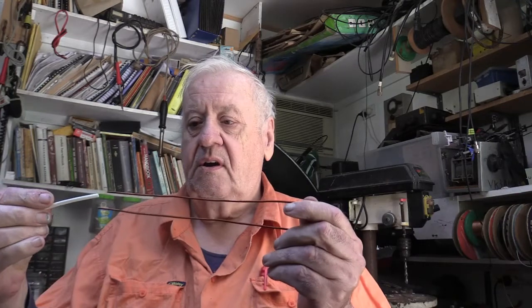This particular balun's only got two wires in it, so it's not too bad. But what I discovered was a friend of mine, VK3ACJ, suggested that I get a little bit of shrink on. And what I actually do is I cut a small piece of shrink tubing and I put the small piece of shrink on up this end here, just where the bend is, and then another small piece at the end of that piece of wire.